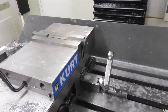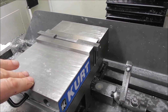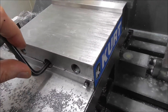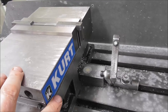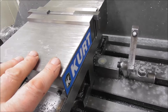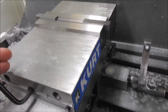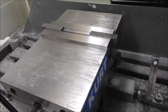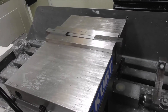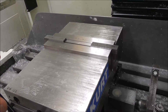You probably know that the Kurt design jaw and many copies have a pull-down mechanism inside that pulls the jaw down. It's really important to keep that adjusted so the jaw doesn't lift up and get chips between the jaw and the body of the vice. Do your housework on that - keep it firm, keep the jaw down - and when you tighten up, the jaw won't ride up, you won't need to hit the part down with a mallet or force the jaws. Just do it up neatly by hand.